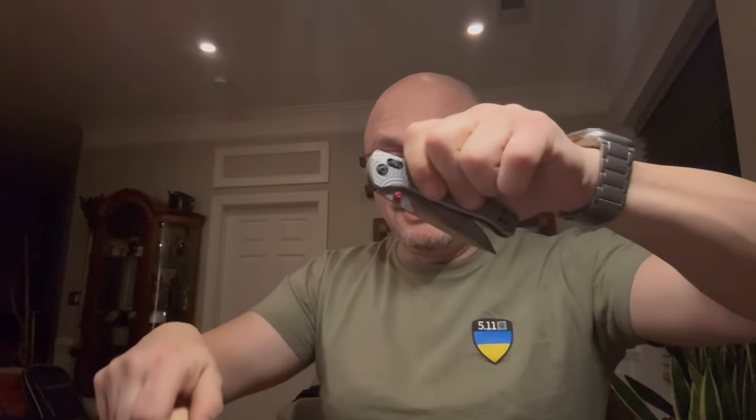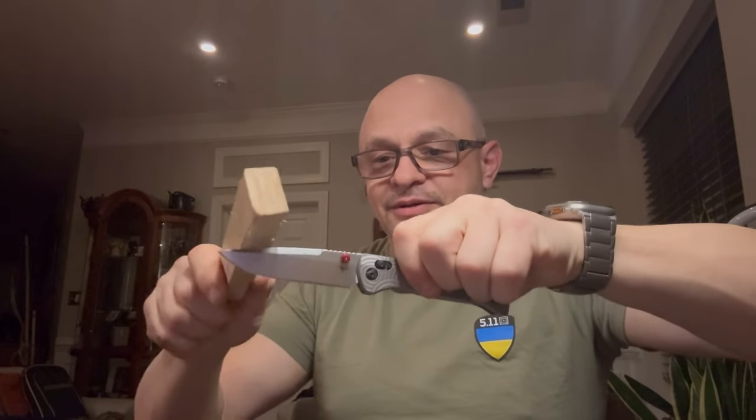I appreciate those of you who stuck around through that interlude — here's my gift to you: a spine whack test. That's one strike and it closes on the second strike. Let's open it again — you have to do a full flick open, then strike: no problem, strike: no problem, strike — same force, and it closes. In this knife's case, I think the reason is when I strike the lock, it moves back just a hair, but because the spring is catching on something — it's so gritty — it doesn't have the energy to come back to a fully locked position.